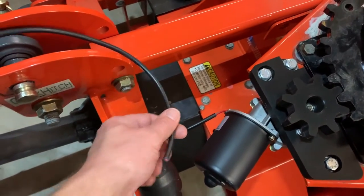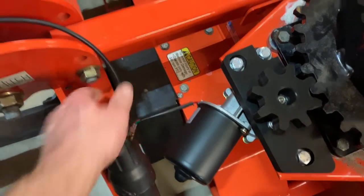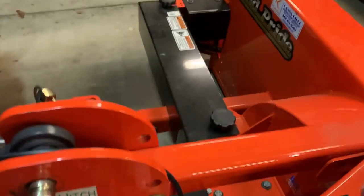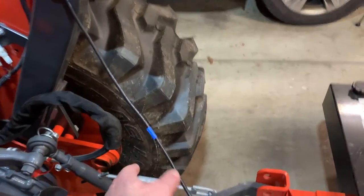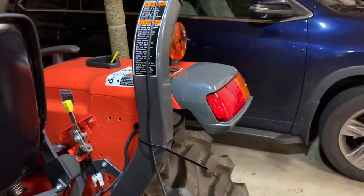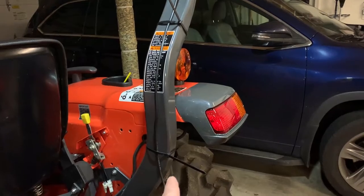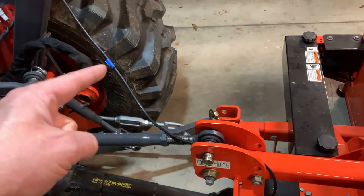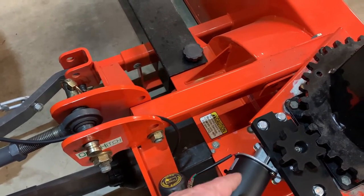I cut my wire. It'll get zip-tied here with a little extra loop down here, which will be held in place with a zip tie so the extra length doesn't become unmanageable. I marked with blue tape the location where I want the disconnect connector, and temporarily put two zip ties up on the ROPS bar so I can see where the wire will sit. Now I'll take this part, cut the wire at the mark, solder the two connectors on, and wire the motor end permanently.